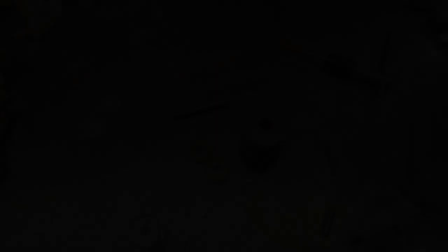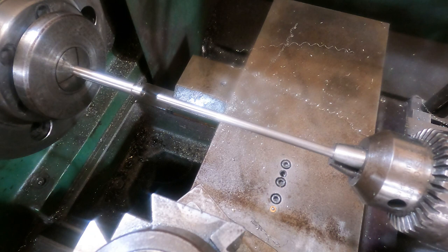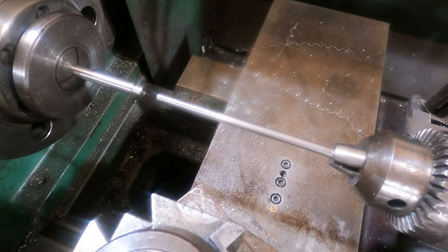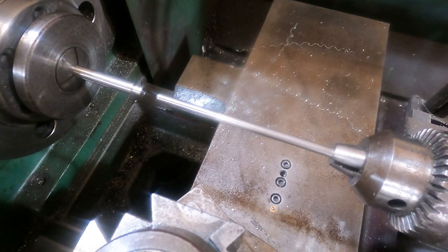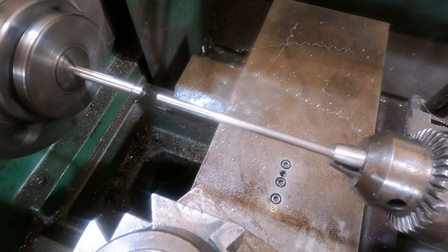I solved my not-enough-hands problem. We're going to run the lathe in low gear just to rotate the part slowly and heat it evenly. When it's heated, we'll use the tailstock to drive the piece in - I'll hit the footbrake on the lathe to stop it. We'll rotate this piece so it heats evenly, then hit the footbrake and drive this in.